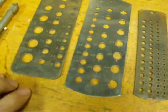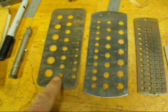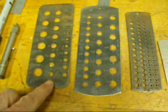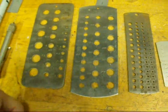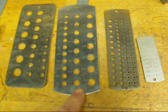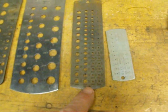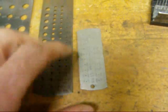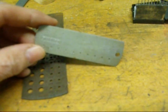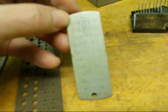If you have an unidentified drill bit and you're not sure what size it is, you can use a drill gauge to check it. Always put the cutting end in first, not the shank end, because the shank end is often damaged or chewed up. We have several drill gauges here: a fractional gauge, letters A to Z, numbers from one to sixty, and this small gauge for the really small number bits from sixty to eighty.